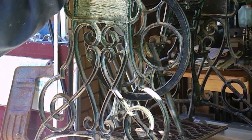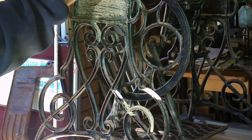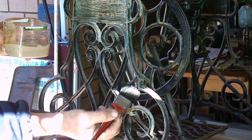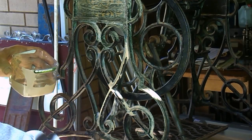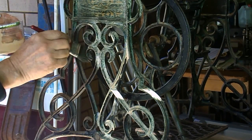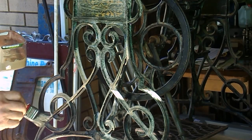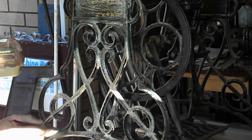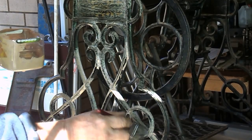You don't go liberally — just give it a nice light coat up the top here. That's actually really good because that was underneath the base, so there won't be much of a problem there. Just keep going over the areas where there's a bit of decal to make sure you don't have large buildup. As this sets, it's just going to turn lovely and black. And where there's gold remaining — if we went in there with a wire brush or something like that, you're going to be removing some of the existing Japanning or black paint that's on there, and you'll also be damaging the gold.